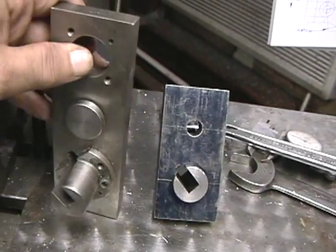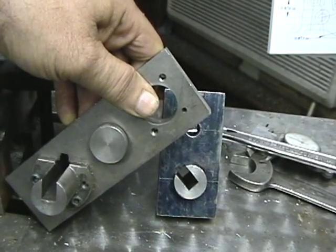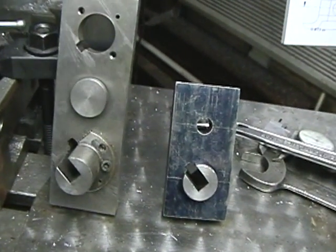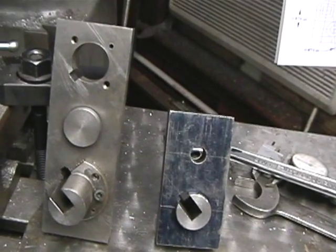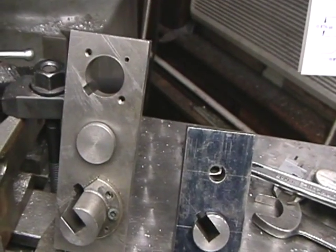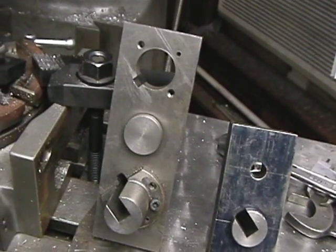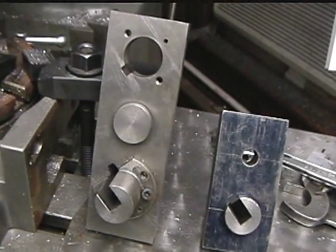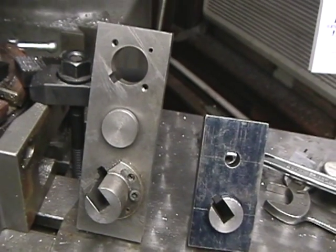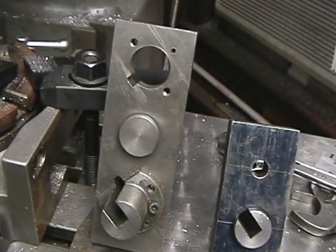This jig is designed so that the right-hand side — the engineer's side of the locomotive — leads the fireman's side. The Pennsylvania Railroad, for some reason, wanted a left-hand lead, meaning the fireman's side was the leading side in the forward running position. I didn't make it that way on the K4 because I didn't want to remake the jig and saw no necessity for it. It makes absolutely no difference when the engine is running — you can never tell which side the lead was on.